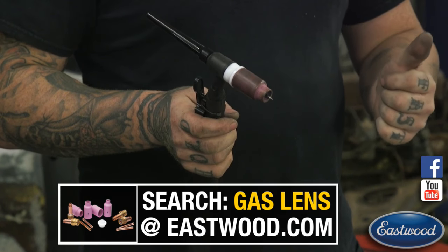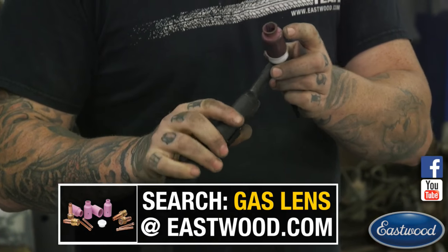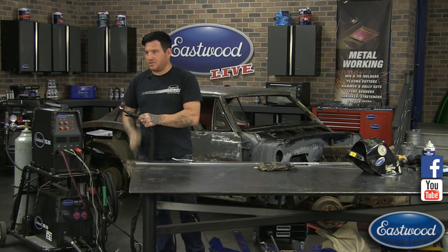So I have the flow turned up, and I have the gas lens with a fairly large nozzle on it, that's going to cover a pretty good area, so we should keep the weld as clean as possible.